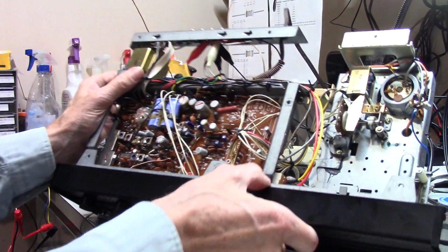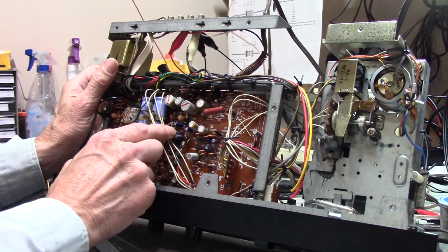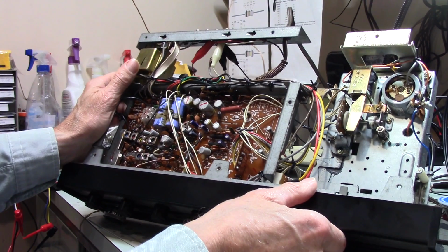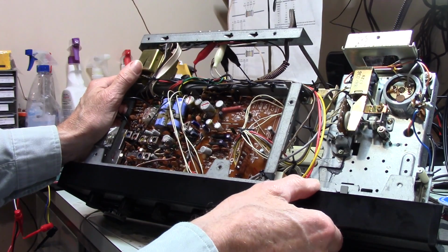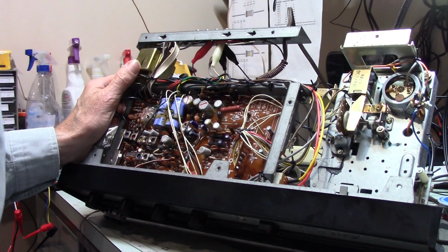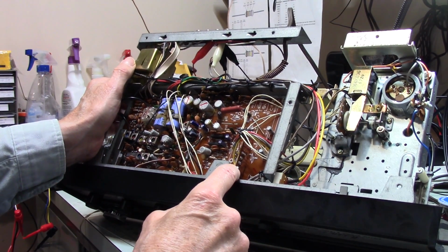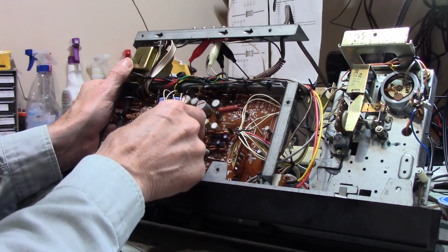And then I know that I've got a capacitor over here. And I look at the orientation if I can see it. Sometimes you can't. But then I look for, okay, there's the ground marking right there, which probably means that this is oriented this way. So I use all the tricks at my disposal to try to figure out where the component is and where the leads are. And even then, sometimes it's not good. And occasionally I have to resort to using my soldering iron to test, okay, have I found the capacitor or not? Apply a little heat, see if the lead moves or not, and if not, then you know you've missed it. So it's a little bit challenging, but it's been okay.